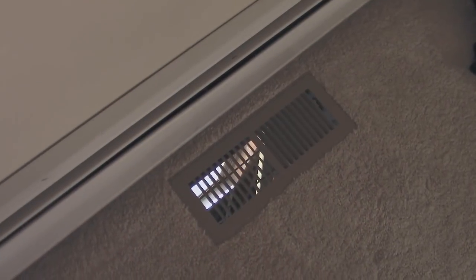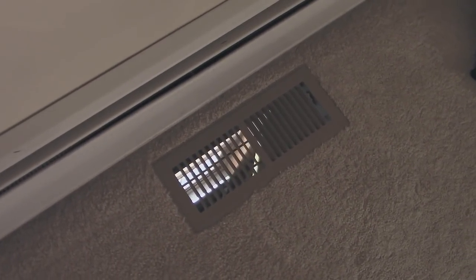Let's fast forward to after this project is done and we'll see how well this actually worked out. Here we are at the other side of winter — I'm recording this in the spring — and overall I think the system that I set up here worked pretty well. The holes are just up between all these floor beams, and I feel like it was a good thing to have done. I took some tissue paper over the gaps whenever I was running the wood stove the first few times, and you could see it kind of blowing the tissue paper up. If you put your feet over that area, it felt very warm. It worked.